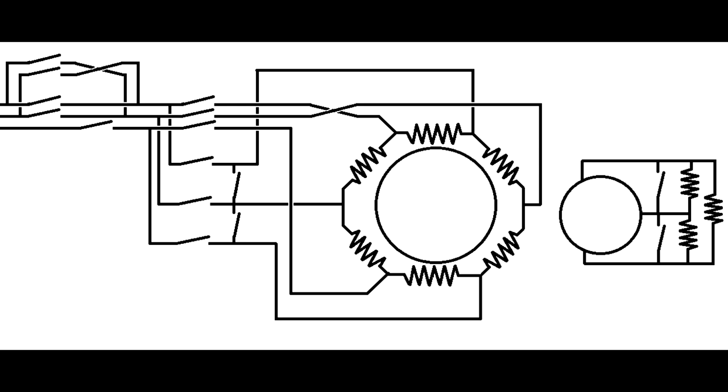One characteristic you can do is to get the motor started from when it stopped. You put resistors in at this stage just to get started. Those resistors immediately get bypassed as soon as the motor starts to speed up. Then when you want to slow the motor down, you put these resistors back in. What these resistors do is create a speed limitation, meaning it runs at full power, full torque, but as soon as the motor starts to get faster, suddenly the torque just cuts off, giving it very much a speed limit. As well as that, there has to be some sort of braking effect, because you don't want the lift to freefall and get faster if the load's in its position. And this somehow actually has that braking effect, but it doesn't have enough to slow it down to leveling speed.